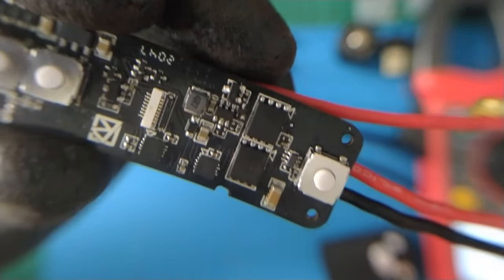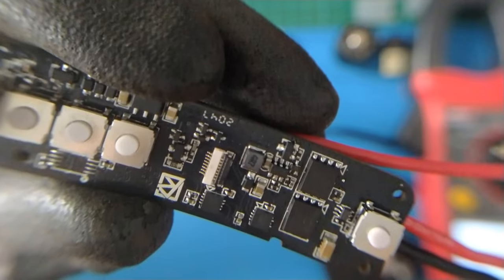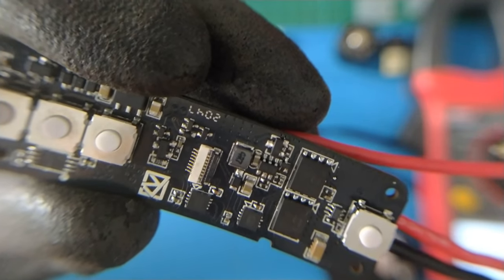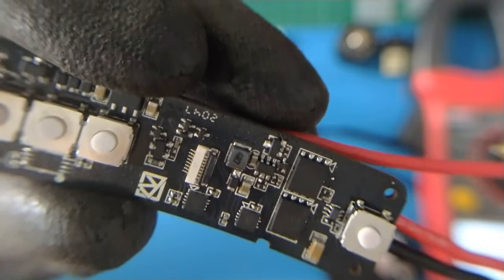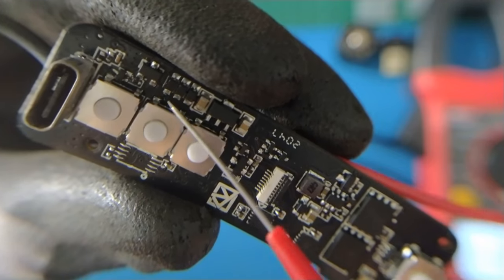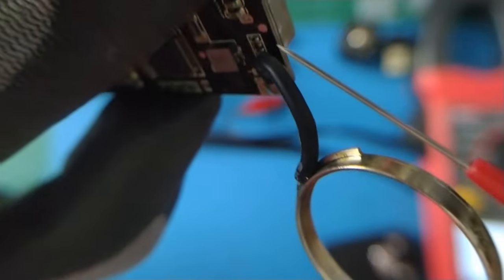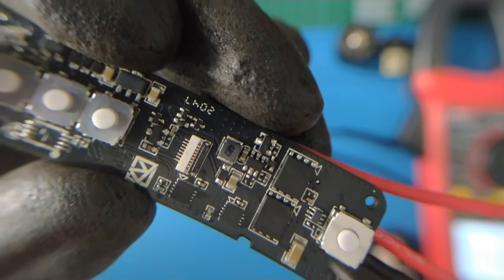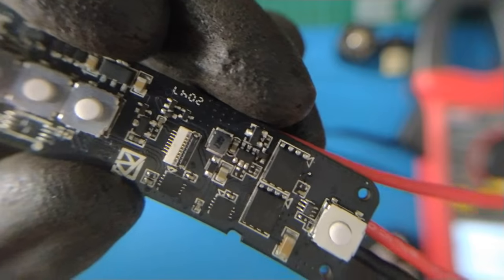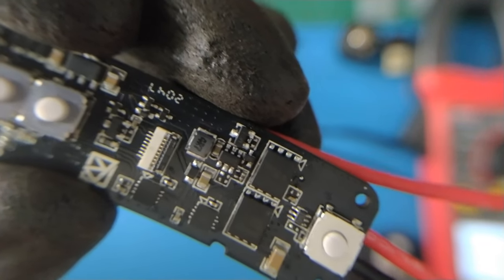The board has three voltage inputs. The first comes from the 5V USB port — commonly the mod uses this voltage for startup of the microcontroller. They can also use this voltage to write a program into the microcontroller for the first time. It's protected against back-feeding from other power inputs and has reverse polarity protection by some diodes, and it's protected by a resistor in case of overvoltage. These three diodes protect the USB port and there's a resistor behind it. The second voltage comes from the 11V boost converter, mainly for driving the MOSFET. It's not a synchronous boost converter — they only use a diode whose voltage drop won't affect too much at high voltage, low current.